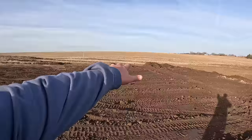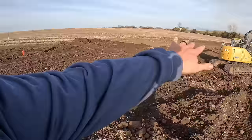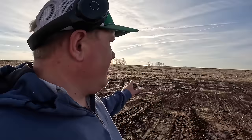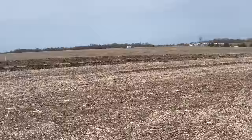That's pretty well on it. We just gotta fill in this backside here. Probably take out a little bit more in that area right there to give it a little more holding area on that side. But it should catch it, funneling into our riser right there. Any of the surface water, which hopefully there's a lot less surface water because of the fact that the side hill will be drained and being used like a sponge, like it should be.